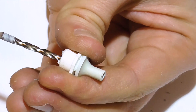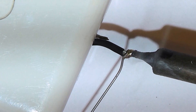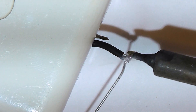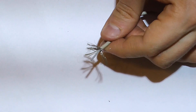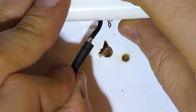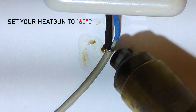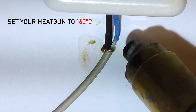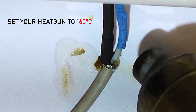I've drilled through it — now we have to make the hole a tad bigger. Pull the wires out a little bit. You have to solder very carefully to make sure you do not melt the plastic. As you work on the wires with the soldering iron, make sure they hang over the table and not over the plastic casing. Do not forget to separate the nylon threads from the negative shield and cut them off, otherwise you won't have a nice solder joint. I will use a heat shrink tube here. You should solder quickly, otherwise it's going to contract too soon. If you use a heat gun, set it to around 160 degrees Celsius — that will make sure the tube gets enough heat whilst the plastic is left undamaged. ABS plastic starts to melt at around 200 degrees Celsius, that's roughly 400 Fahrenheit.